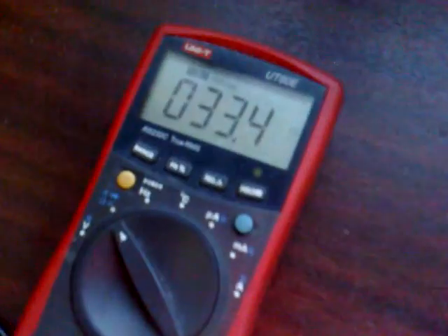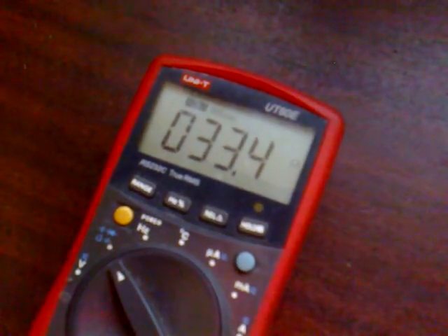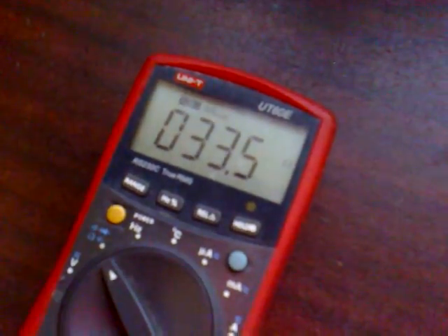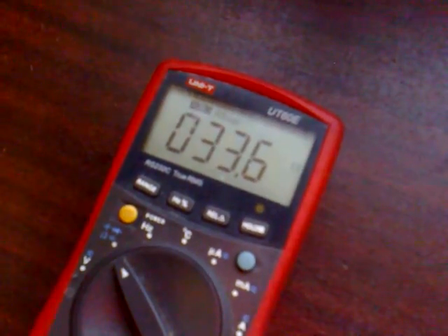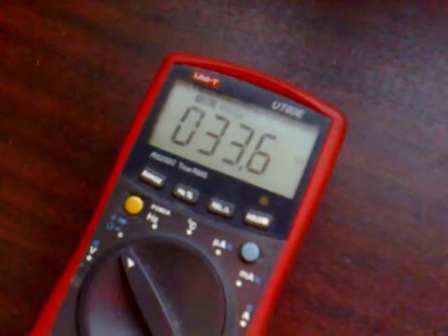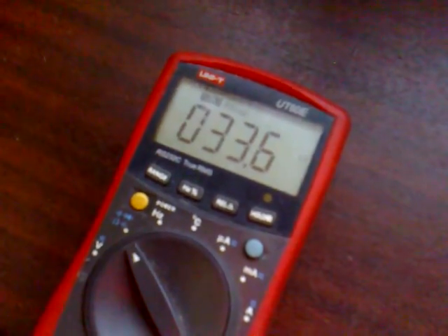It's nice and bright and the ohms reading is 33.4 ohms — so that's our control reading, about 33.6 ohms. If I can get that reading with the piezo inverter, we're at mains brightness. So I'll move everything over to the piezo inverter now.